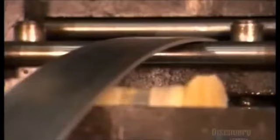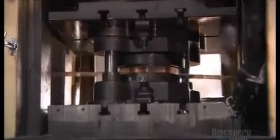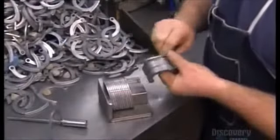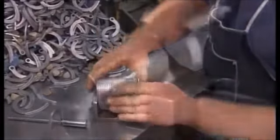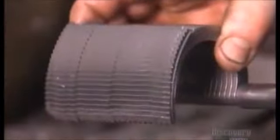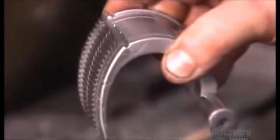Handcuffs start with a roll of steel. A machine pulls it through a straightener, and then through a die that punches out a handcuff frame part. A revolving barrel cage sifts out the waste and kicks the frames into a bin. Here, a worker stacks U-shaped steel parts on a fixture, which he then clamps onto a machine. A cutter makes ratchet teeth in the parts. Coolant keeps the tool from heating up and getting too soft to do the job. Each set of handcuffs will have 2 of these ratchets.